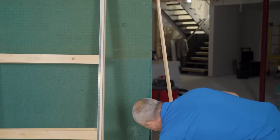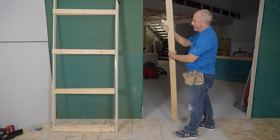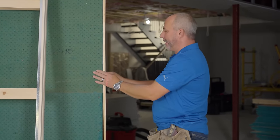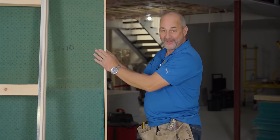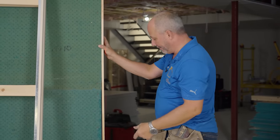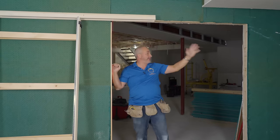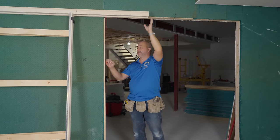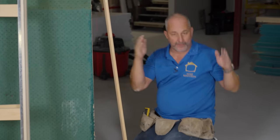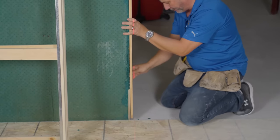First time pulling the laser level out on this job since I've been here. I'm trying to build a wall inside of another wall and keep it uncoupled, but I don't want it to fall over so I'm putting one screw in temporarily. I've got four screws at the bottom and access through the top so I can make adjustments as I go. Now it's a system: two-door setup where one continues across the top, the bottom adjustable via those screws. I won't know if it's perfect until the doors go in — they'll tell me everything.